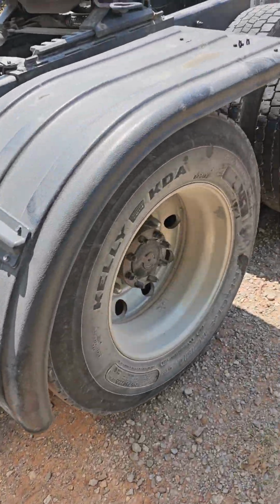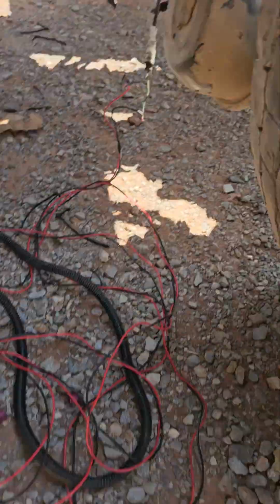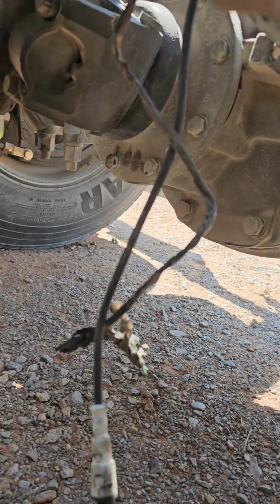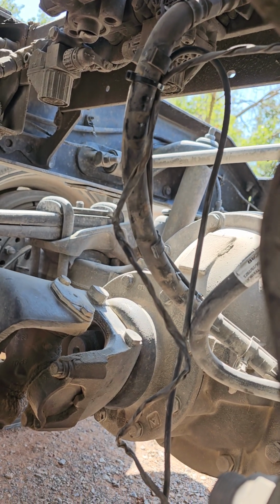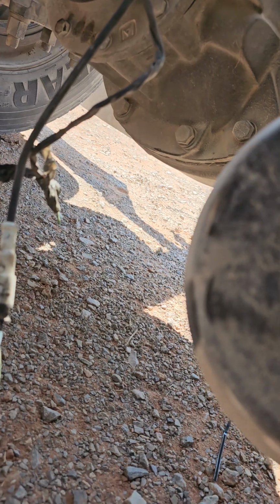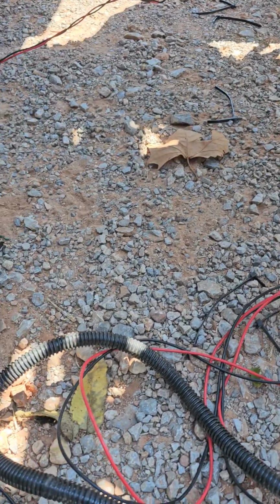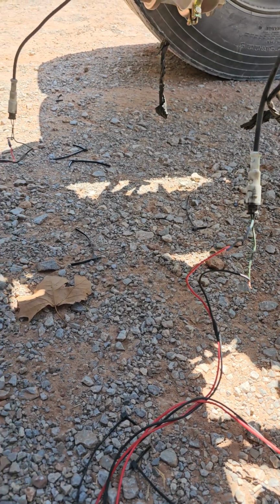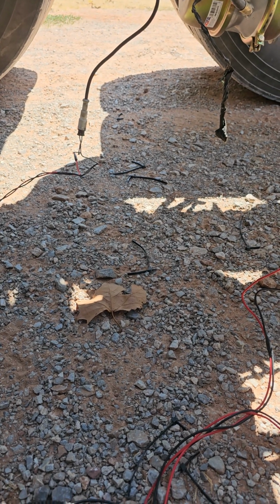I actually changed the wheel speed sensors first, and they were probably good, but come down here, these connectors here, so I cut them off there. They hang down from up top here, and they're usually wrapped around your air hose there. They're all bunched up, and you take them apart, and then I ended up just replacing all four wires, two to each one, just so they could all be running the same wire loom. As you can see right now, I haven't finished the job, but I've got them connected, turned the truck on, and my open shorted fault on both of these sensors is now gone.